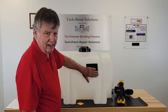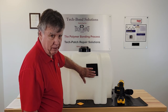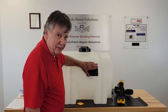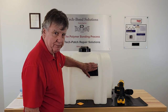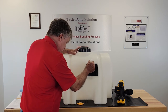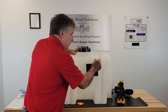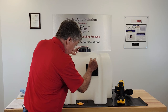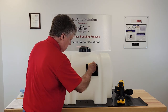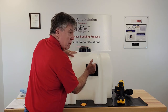What we need to do is what we call 'plus the patch' — putting adhesive on top of the patch in several coats until it's rigid enough so it will not budge. It will still have some flexibility to withstand the addition and subtraction of contents, but it won't elongate. To plus the patch, we run beads of the SI Black adhesive over the patch, then take the glue squeegee and spread it. We start with three coats of the adhesive before using our catalyst.